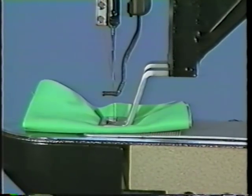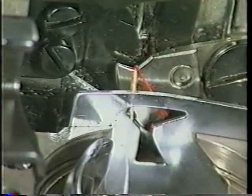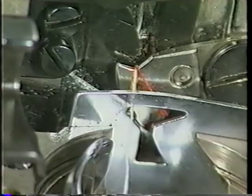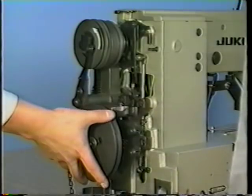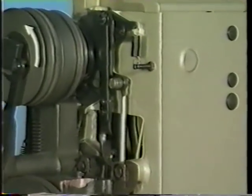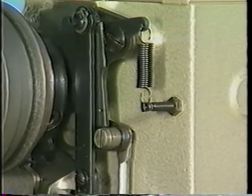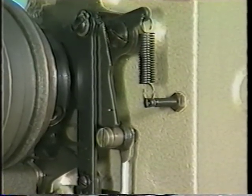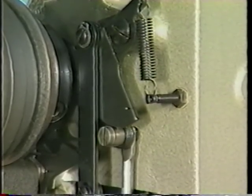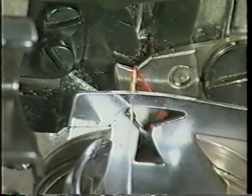Before the work clamp foot goes up, the moving knife does not trim the threads but merely catches them. When the work clamp foot is going up, the thread trimmer auxiliary cam presses the thread trimmer cam arm and makes the moving knife engage with the counter knife blade to trim the threads. The thread tension controller opens at the time of thread trimming.